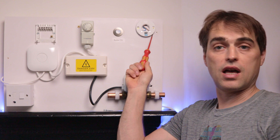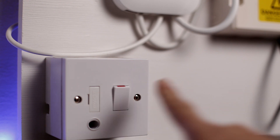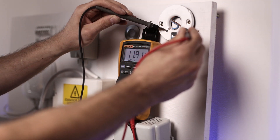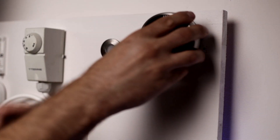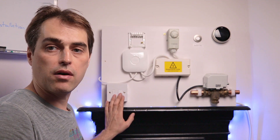We're ready to turn the power back on. I still haven't installed my Nest — I want to turn the power on first and verify I've got 12 volts going to the base, in case I've mixed my wires. With 12 volts going to my base tested and confirmed, it's safe to plug my Nest in and turn the power back on.